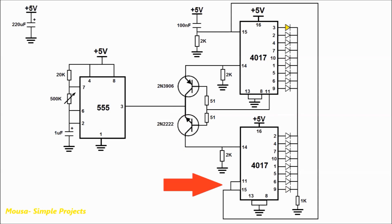Then the last channel in the second IC, which is connected to the reset pin number 15, resets both ICs. And this process repeats again and again. I used the 555 IC as a clock pulse generator. This RC network is used to reset both ICs at the beginning when you switch on the circuit by making a short pulse. This 1k resistor is used to protect the LEDs by limiting the current.